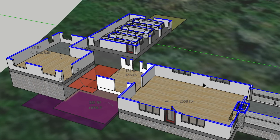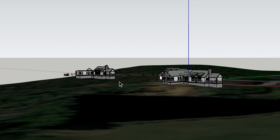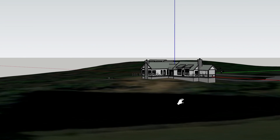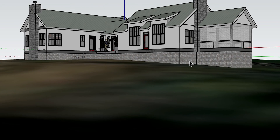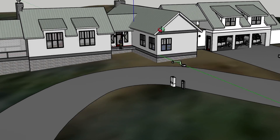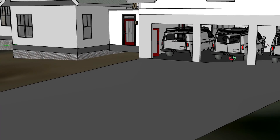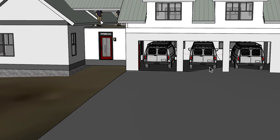Designing for the site — orientation matters. You can't just take your favorite floor plan and plop it down on a piece of land, especially if you have key features of the landscape you want to orient to, like a sweet view of a pond or mountain, or access to the sun for passive heat gain and solar energy production. One of the biggest challenges of custom home design is combining all of the occupants' needs and wants into a working floor plan that works well when built on the land and natural terrain. The pro version of SketchUp has a geolocation feature, which we use to illustrate how the building will sit on the land. With ease, you can locate your site and import a pretty accurate terrain map that shows the contour of the land and get a really good idea of how tall your foundation walls may need to be to accommodate the sloping terrain — and figure out where a basement or a garage might be best suited on the landscape before you get too far developing a cost-prohibitive floor plan.